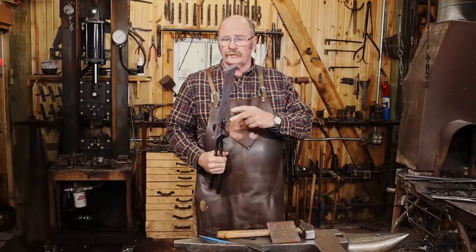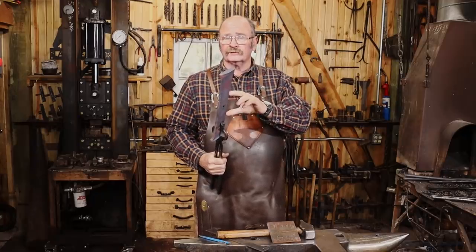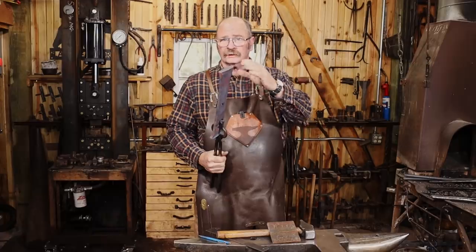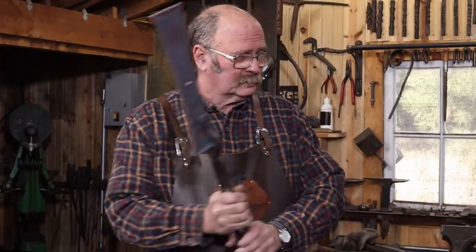Upset's done on both ends, and I think I've got the hole centered. We'll have to measure that again when it's cool and make sure that it's perfectly centered. If not, we'll either have to draw out the short end or upset the long end back a little bit to make the whole thing centered. So we're going to let that cool